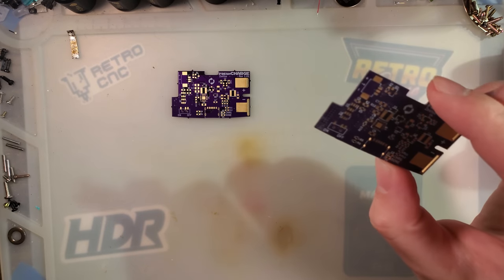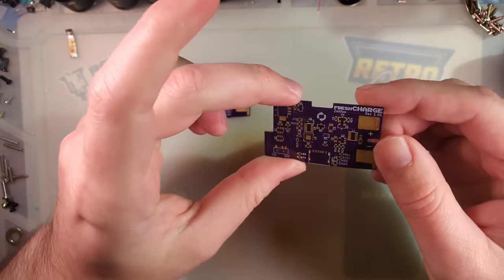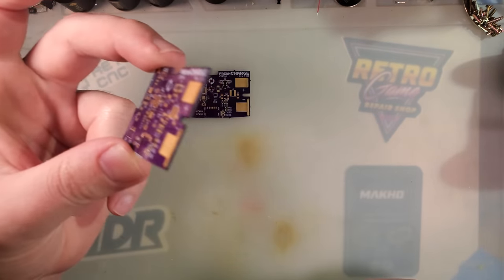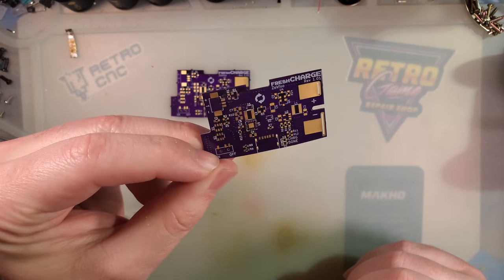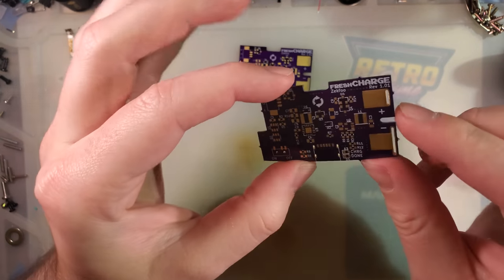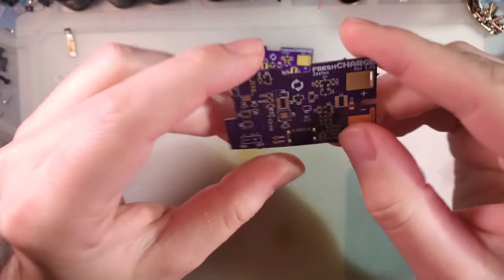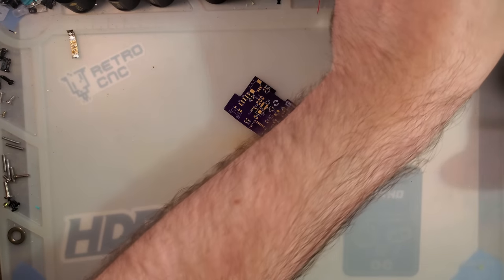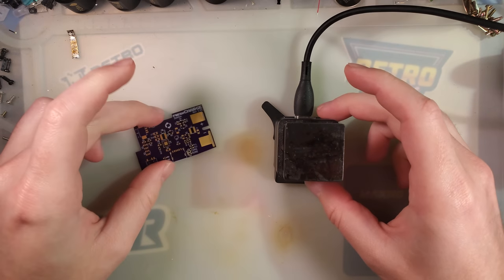Probably looking at this going, oh, well, if there's no switch, it must be locked to half an amp to charge. And no, actually, it's a much more efficient chip that doesn't overheat. And so 1 amp is fine enough for charging. Anyway, let's go ahead and get this populated. These boards came from OSH Park, which is why they have these little nubbins on the end there, but I just went ahead and filed them off. And let's see if I can't populate one of these boards out.